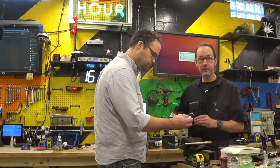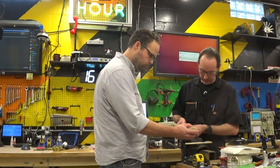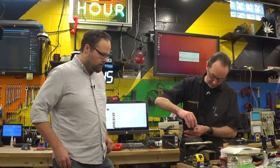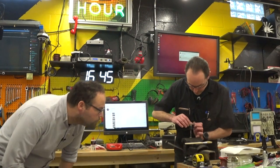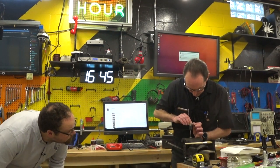Now when you're tapping, lots of lube on the tap. Yep, on the tap. And a little bit on the hole. All right, check us for vertical, sir. I look good this way. What do you got? Yeah, you're good.